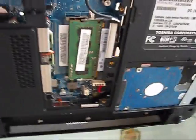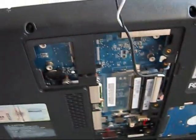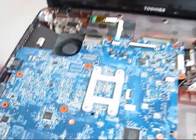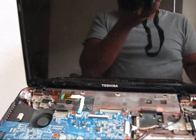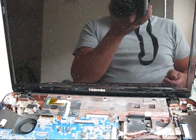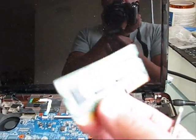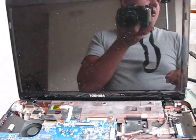I will demonstrate. The RAM module is removed — no RAM modules installed. If I start it up, it will spin a little bit, then full power. As you can see, it's not a video issue — that's why I do not attempt a reflow or reballing on an already working GPU. This is for sure a faulty RAM module, CPU unit, or CPU chipset — the processor.